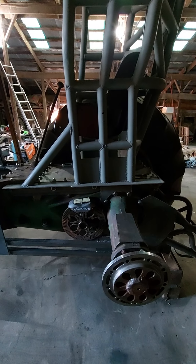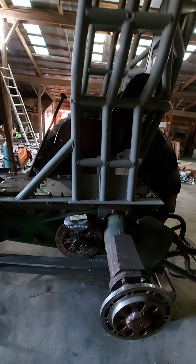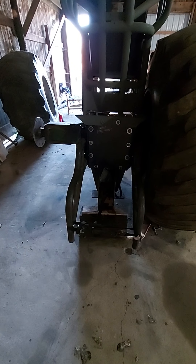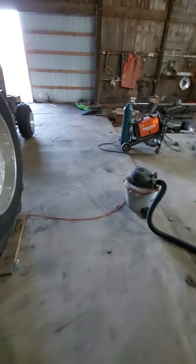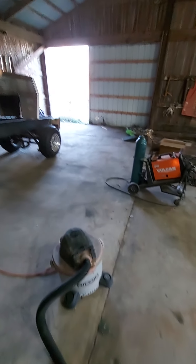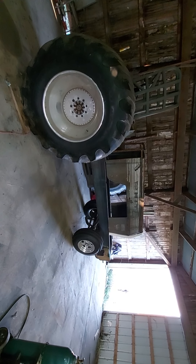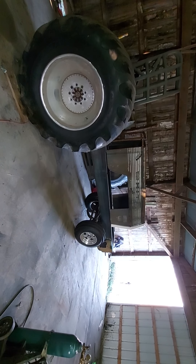On this side, that's the way they're going to look. I did the other side first, and I'll tell you, the other side does not look like this side. I welded all the bars on the plates and then had that 'oh crap' moment — I wondered if the brake rotor was going to fit, and of course it didn't. So I had to cut a notch out of it and piece some stuff in. That's just the kind of stuff that happens, you learn. We got it tied into the frame right here too with some bolts, and that's how it's going to look on this side.